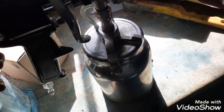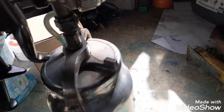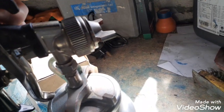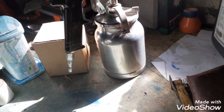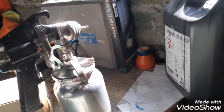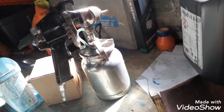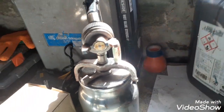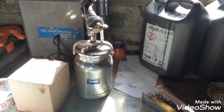This is the spray gun we used — it's a Draper, and it holds quite a good bit of paint. You connect the compressor hose up to it and the paint mixes with the air and sprays on. It's really good; it didn't block up as long as you wash it up correctly. The key thing is that within five minutes of finishing you have to have it all cleaned up, because the paint will dry and block it up next time. We used standard thinners for washing it out.